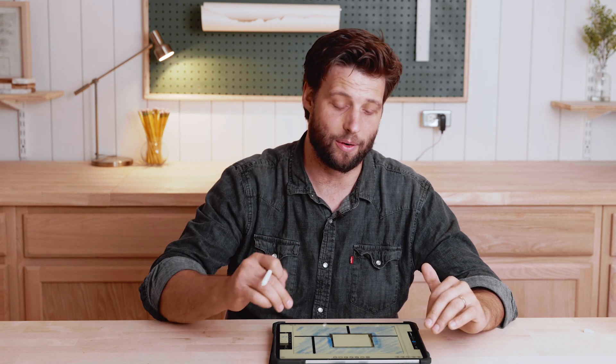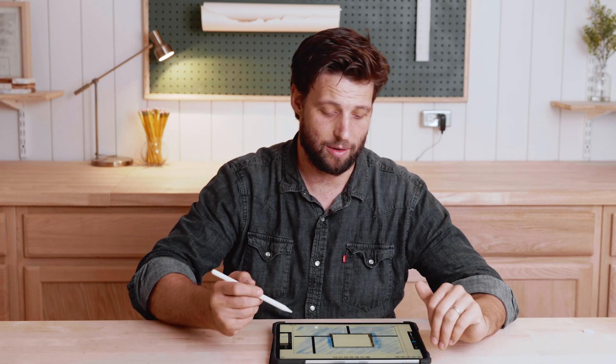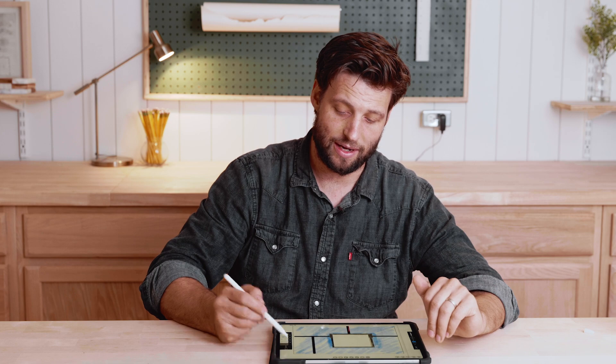The purpose of this pan is so that when water gets through that window — which it may never, but it might — it leaks down and hits your waterproof pan. You can build the pan flat with a back dam on the backside: a little ledge the window goes in against so any water that comes through can't go into the house. I prefer to set my sills at a five-degree angle, tilting them so any water that gets in there drains to the outside. The only way this works is if you get all of the details right.